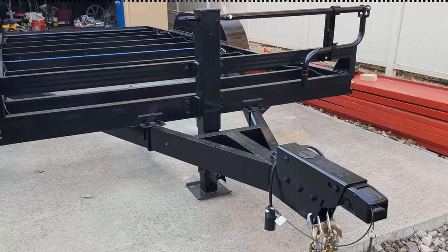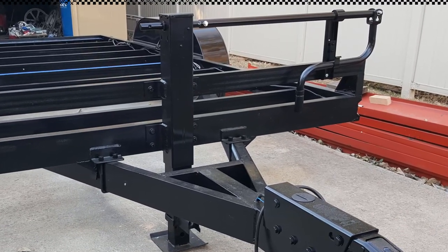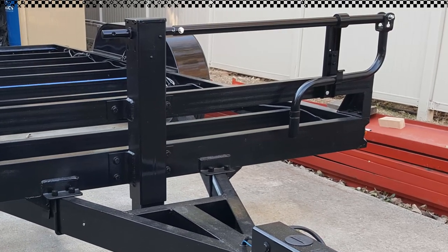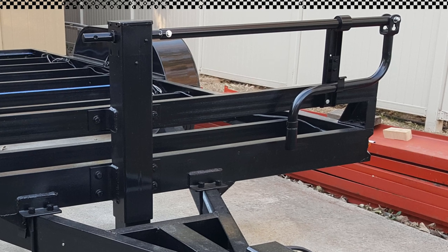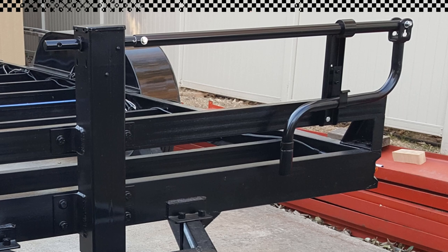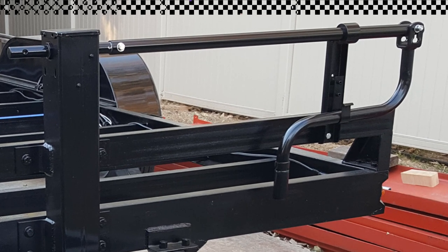And here's a front view of the trailer. You can see we've got the safety chains on it, the wiring harnesses there, the surge coupler. Gets a better view of what's going on with the jack drive shafts. You can lift that handle out of the cradle on the front there, and it slides onto the drive shaft. It holds it in place, and then you crank the landing gear as you need for coupling and uncoupling the trailer.